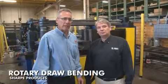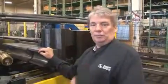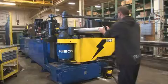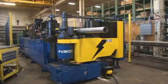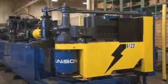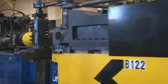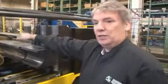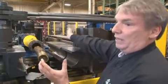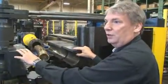One of the most common forms of bending is rotary draw bending. This type of bending requires a lot more tooling, and is normally used when bending a tube three to four times or less the centerline radius relative to the tube diameter. There are three pieces of tooling always needed: a bend die — cut for the tube diameter and radius you want — which is what it bends around; a clamp die, which clamps against the bend die and holds the tube while bending; and a pressure die, which applies pressure to the back of the tube as it follows along during the bend.